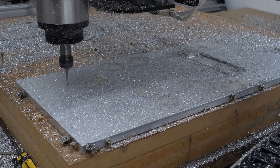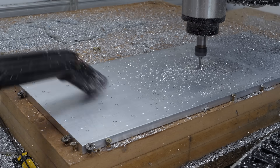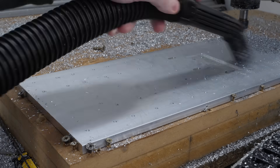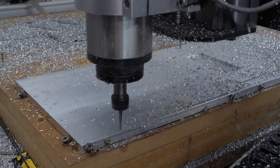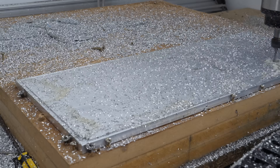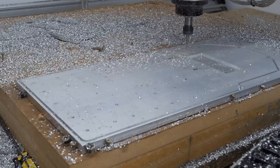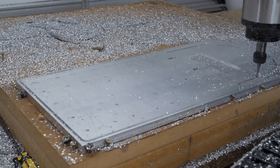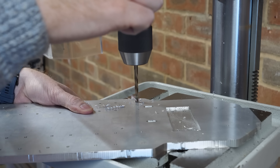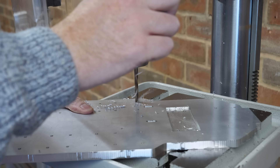I've built my trebuchets, my electric bikes, all sorts of aircraft things out of carbon fiber — so it's done me well, but it's just time for an upgrade. The guy who assembled it didn't use any thread lock on any bolts, so occasionally bolts come loose or fall out and ruin whatever I'm cutting. Every time a bolt falls out I thread-lock it and put it back, then something else comes out — it's just unreliable and a pain to use. I also tried to reduce CNC cutting time by only partially drilling holes, then finishing them on the drill press, since drill bits are a lot cheaper than CNC end mills.